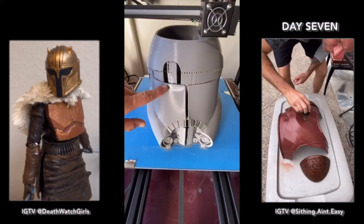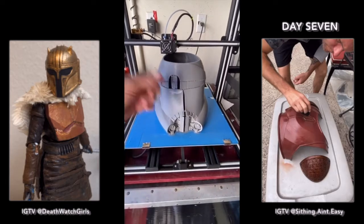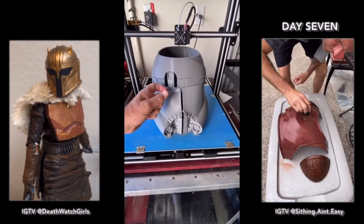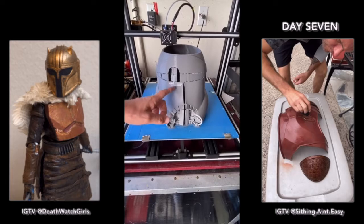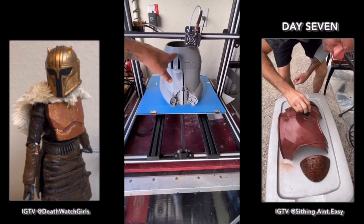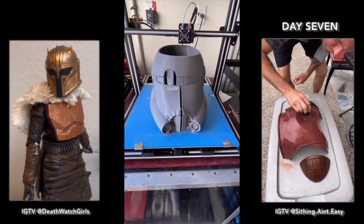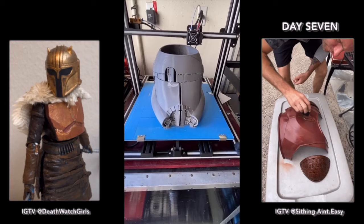So all this white stuff, I put super glue on there and I paused the print, pushed the wad up against here, super glued it, and then came back out. There was a little puck, and it fully built back up, which is huge because if it didn't have this support right here, this would have just been a big old wad of spaghetti.